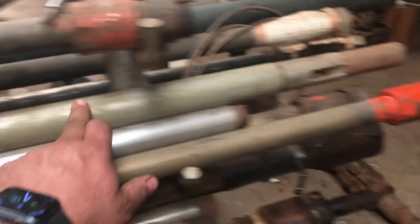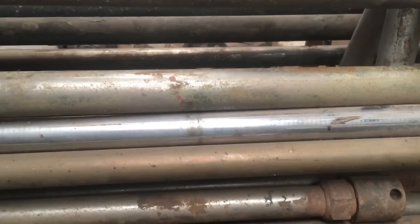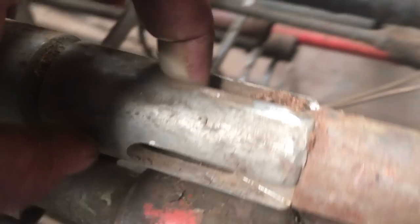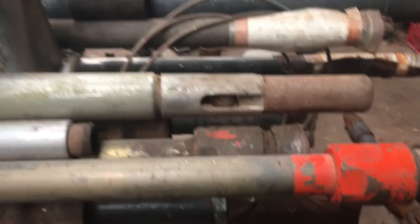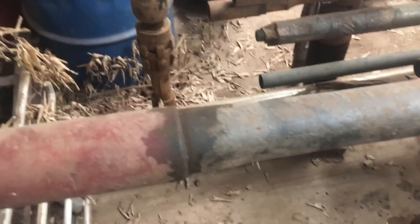This is the type of plunger I've got in the barrel. You'll notice there are no actual seals — the only sealing is that this fits very close and very tight inside a chrome bore inside that barrel. This is what's called the traveling valve or the plunger. There's a ball and seat inside — that is the valve. There's another piece called a standing valve; it has seat cups. You drop it from the surface down the tubing, it falls and seats — it's just a check valve that lets fluid come up but not fall back down.